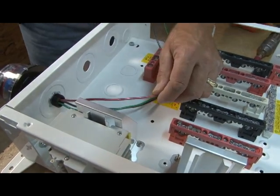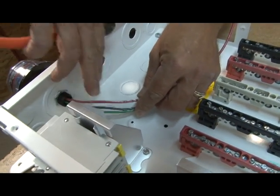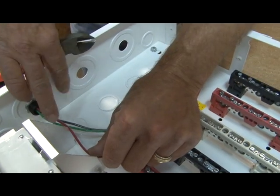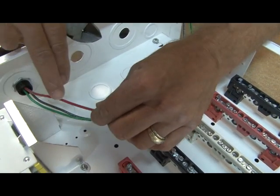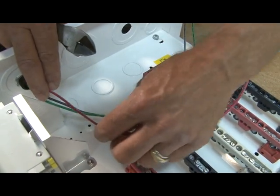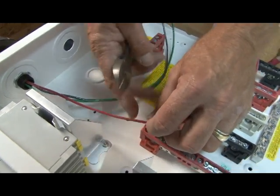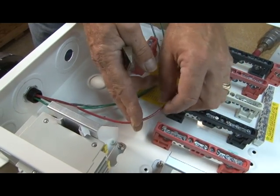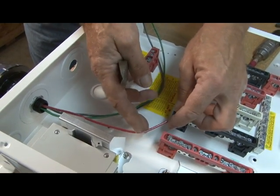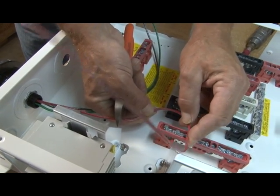When I run my wires down, watch for sharp corners right here — you don't want the wire rubbing up against it because it's going to break through your seal. Make sure your wires are straight, and when you have to make a bend, make a nice easy bend. It doesn't have to be sharp — you don't want it sharp. Lightning does not like going around sharp corners.